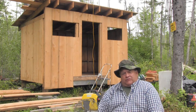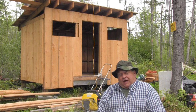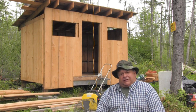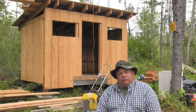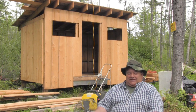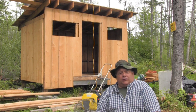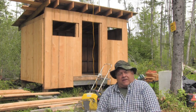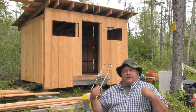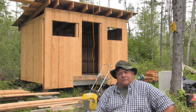Today I've got to trim the roof. I'm going to set the camera up so you can watch. All I do is run the boards up there full length, let them hang out over the edge a bit, chalk a line, and run up that line with a skill saw. That way I end up with a better edge for the roof, and it's just a lot easier on the day of nailing it down. Today I'll also be measuring the roof for my steel roofing and getting that ordered, hoping to pick that up sometime next week. The windows will be coming in next trip.